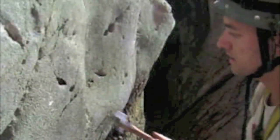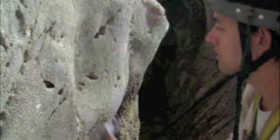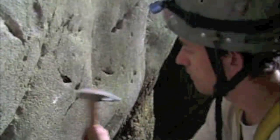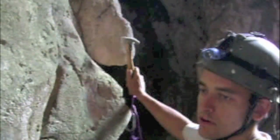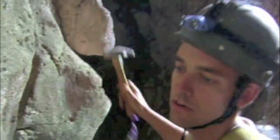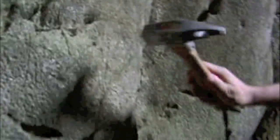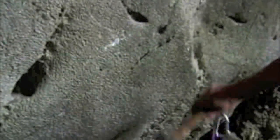The real ultimate test is to take a sufficiently heavy hammer and just give the rock a tap. The ring that you can hear from that is pretty solid. Conversely, if the rock wasn't solid — we have a look at some rock now — that's quite a distinctive difference in sound. That's a good indication, and we might want to also just have a bit of a tap around the whole area to make sure it's not just an isolated pocket of good rock.